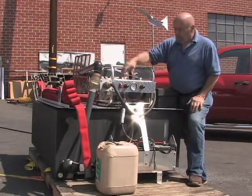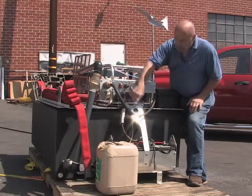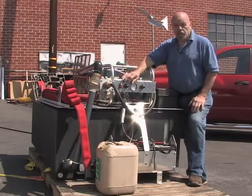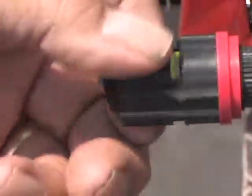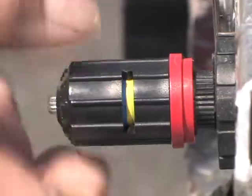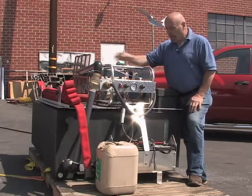The way we have it set up, this valve on the left — we use a red tube most of the time, but not always — that goes down to your surfactant, and that's your ratio of surfactant. You mix it with this dial by opening it up, turning it counter-clockwise, closing down by turning it clockwise. That determines the percentage of surfactant you put into the water supply.